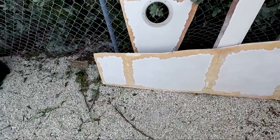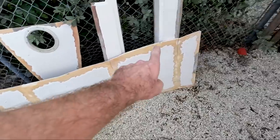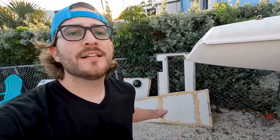You can see there are some joints that I've got to glass over — I've already glassed the back side of those joints, so that's done. Now I've just got to fill the inside of the joints with thickened epoxy and then glass over top. First I've got to mix up some thickened epoxy and glue those pieces down to the tabs, and then before that's even dry I can go over with thickened epoxy, fill all the joints, and glass over top. By the time I'm done tonight everything should be glassed in. Once it's dry it should be pretty structurally sound — this is a major milestone for this project, putting it all back together.